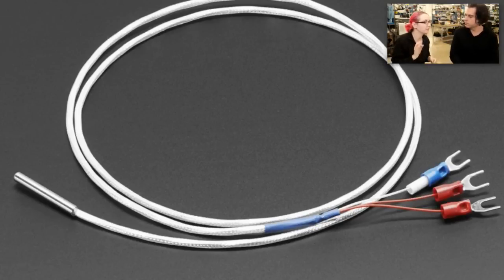This is a really nice sensor for people who want to do scientific research where you want very good repeatability, accuracy, and precision. It's about as good as it gets for the amount of money you're putting in. For about $15 this is an excellent temperature sensor with a nice stainless steel tip — great for uses when a thermocouple is not precise enough, but you want more range than our precision I²C sensors, which can't go beyond 100 degrees C.